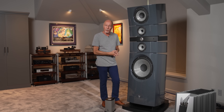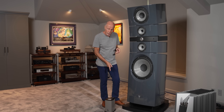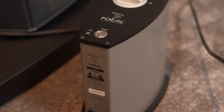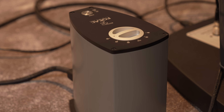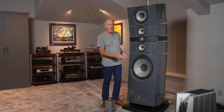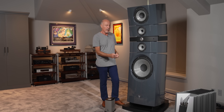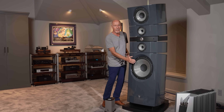This plugs into a wall and it comes with a control box. This control box allows you to fine-tune the flavor of the bottom end. People talk about East Coast sound, West Coast sound — the flavor of bass from a sealed cabinet versus a ported cabinet. I can turn this knob and fine-tune this bottom end to my room and to my own personal taste. The resonant frequency of this driver is like 21 hertz — this thing goes deep and is extremely, extremely fast.